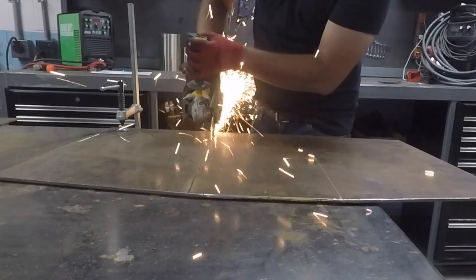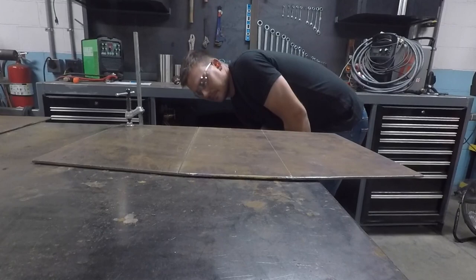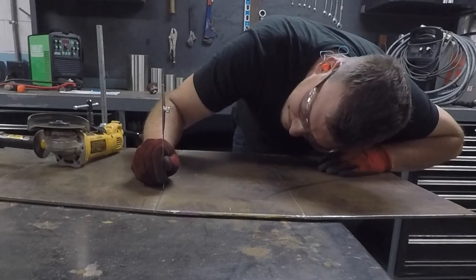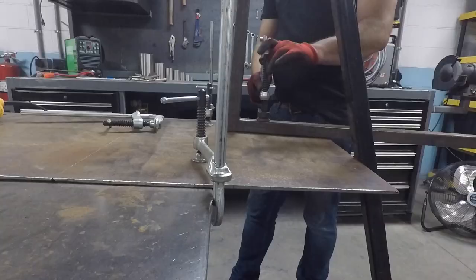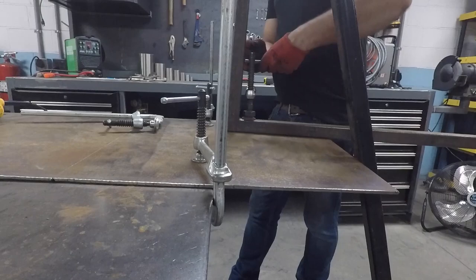Now I'm going to attempt to bend the quarter-inch steel plate. First, I slice it with a sixteenth-inch cut-off wheel, followed by an eighth-inch grinding wheel, followed by a quarter-inch grinding wheel, leaving the groove kind of beveled, going a little less deep each time. Then I check it with a ruler to make sure I am far enough through to bend it, but not so far as to slice the whole way through the plate.